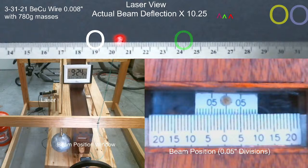Now Riley, on the other hand, built his out of clear acrylic. His case is nice and transparent, and that's all fine for looking at stuff. But keep in mind that I can't think of anything that would hold a static charge any better than a piece of clear acrylic. If he's not having static electric problems, I don't know why he's not having them.